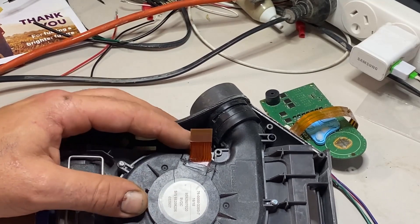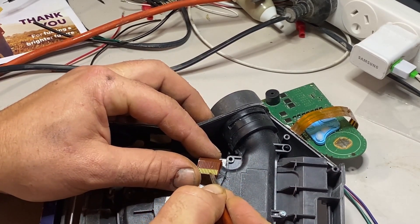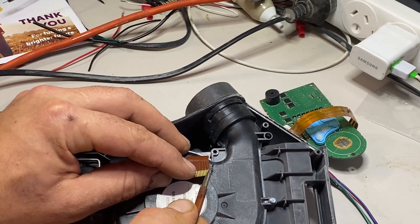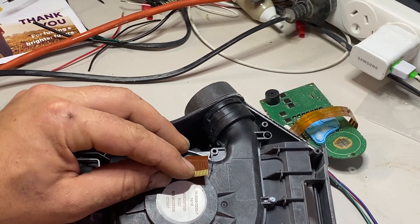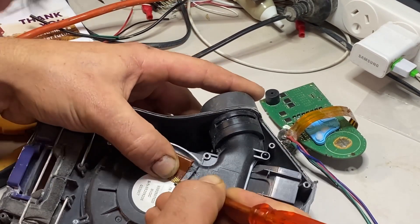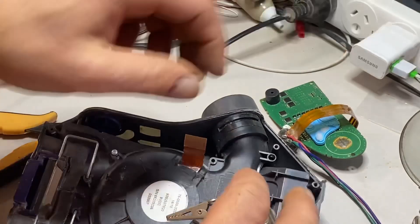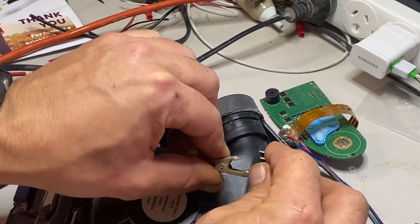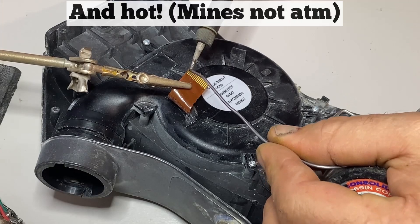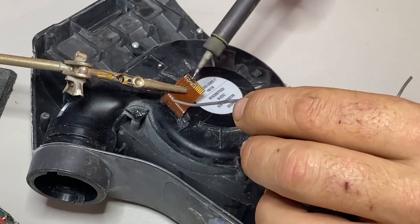So this is the tricky bit. You have to tap into these six pins here. Scratch up these contacts a little bit because you need to solder wires over here. You bridge two, two, two — so there's a total of three wires coming out of the ribbon. It helps if you've got an extra hand, and it's easier with a smaller soldering iron. Make sure the tip's clean.